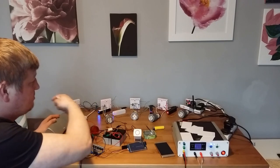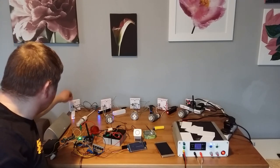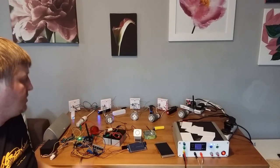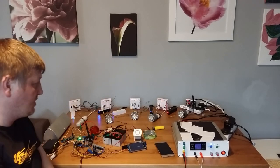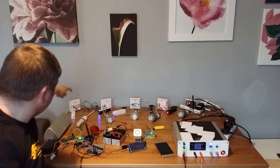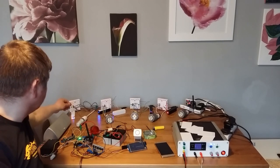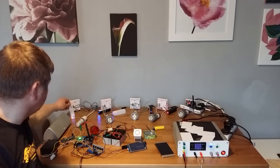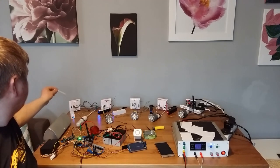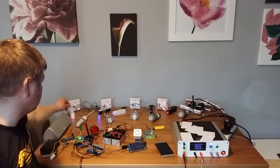So in that case, the sensors maybe will not work, but they do work, because as you can see, I put a backup battery for each one individually. So this one is a backup for that one, and so on. I have a battery for each individual module in case the power is cut. And the same I'm gonna put in those softwares, because I have one software running here, another software there, and so on. I'm gonna put in the software a way to read the power that is charging the battery, and in case that power is off, to send me a notification telling me, oh, the module from the kitchen is running only on the batteries, the 220 volt is cut off, and so on.